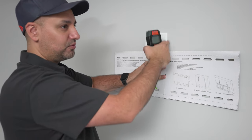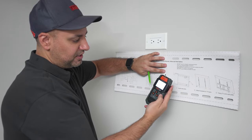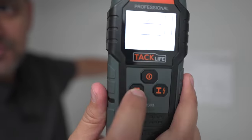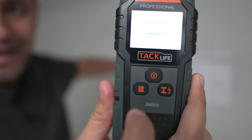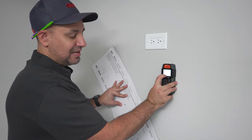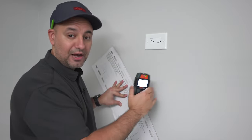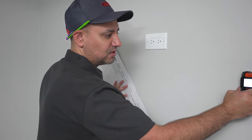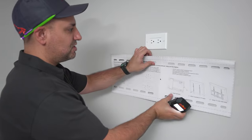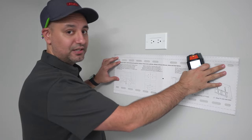In my case it was exactly 46 inches to each side wall. Now I'm going to turn on the stud finder — if you use the same one I have, it has a setting called exact. You press this option right here and it gives you the exact setting. It has a sensor on the back and you just drag it along the wall. Right here is the center of my stud, so I mark this as the center. Every 16 inches from that center is going to be another stud. I only need two studs. Some stud finders show you the edge — a stud is an inch and a half wide — but I only care about the center, so I want my screw right in the center of that stud.